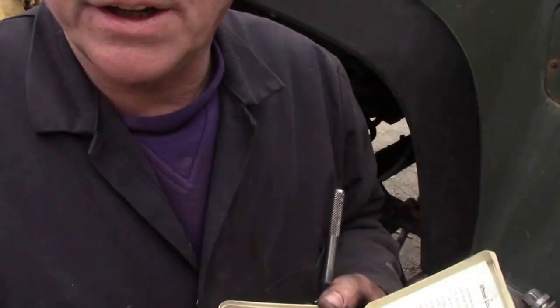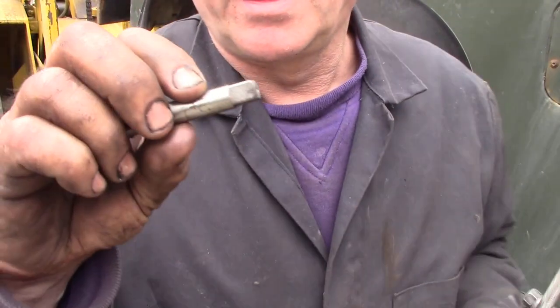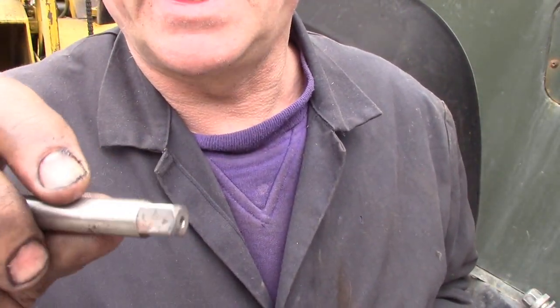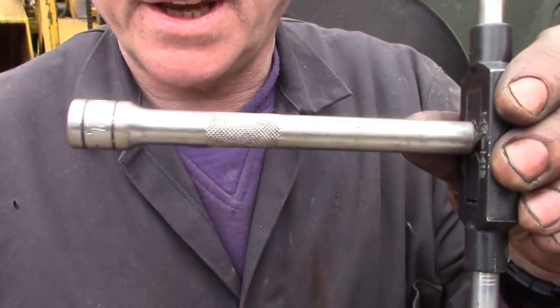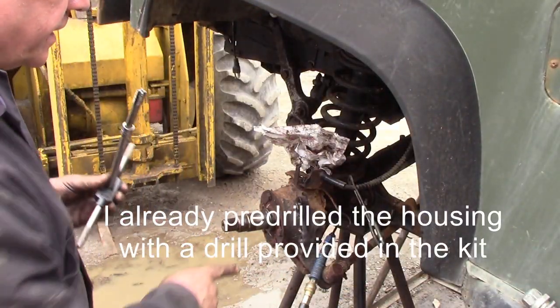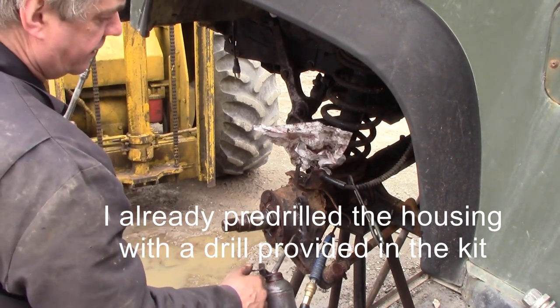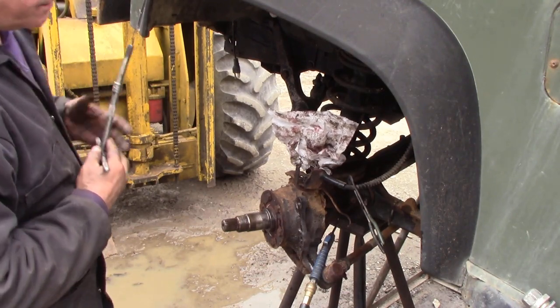There's almost like a 10mm head on the tap, and of course you can't get a standard tool in there. So by using an extension bar backwards, you can actually get in to tap it. I'm going to put some oil on here — it's a cast iron type thing — but we'll give it a go. It's not too difficult to do actually.